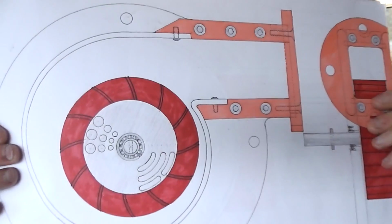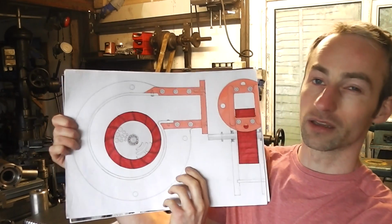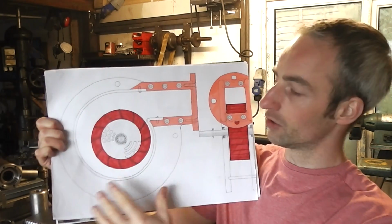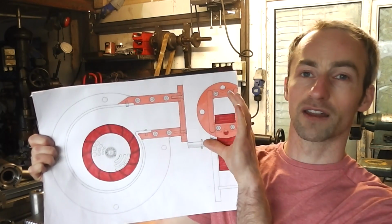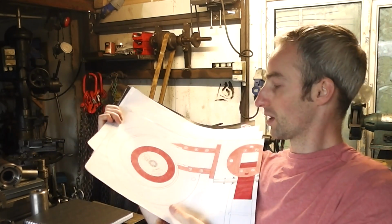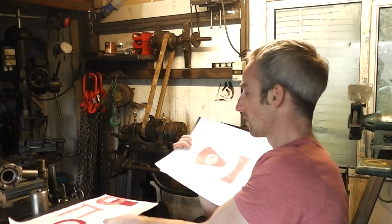There we go. This is a centrifugal fan, standard bits. You can buy this fan off eBay, it's only about 12 quid. The bits are nice and replaceable, easy, cheap. It's all acrylic, you can see what's going on. These are standard fittings there, drillings there, there and there. All these flanges all fit together. There'll be an adapter plate between this size and this size. Oh, and also standard shaft is all 12mm with a little ball pin drilled through it.